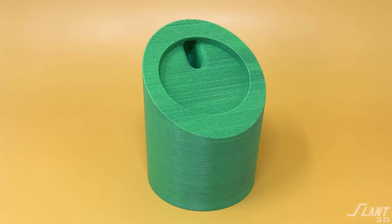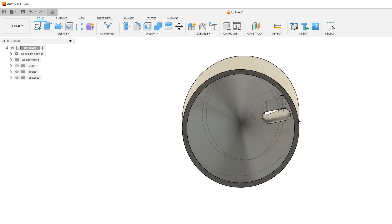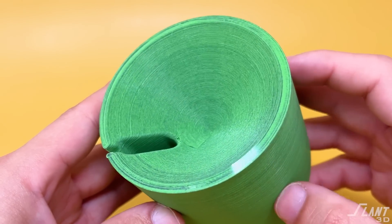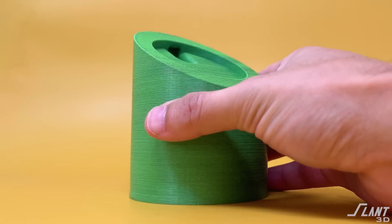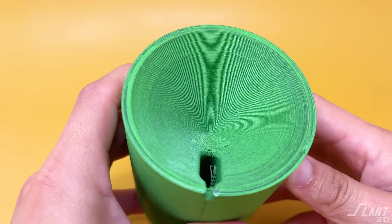With this type of design, the main thing to make sure it is manufacturable is to ensure there are no overhangs, and the bed adhesion is minimized, though not to the smallest degree possible. In the bottoms of all of these, we made conical cutouts. This ensures there's no overhang, but makes sure the part sits more level on a table — you don't have to worry about any warp over time, and you have this outer ring so it can easily be auto-ejected.